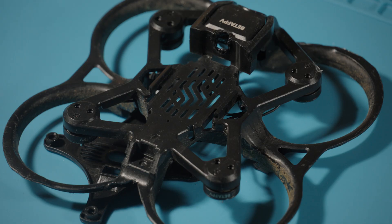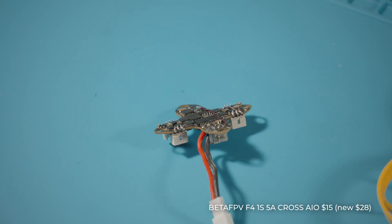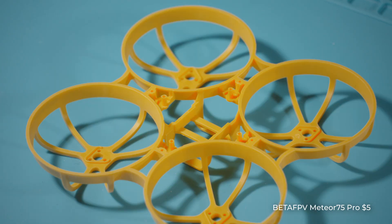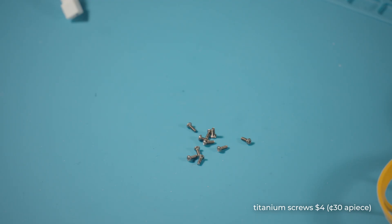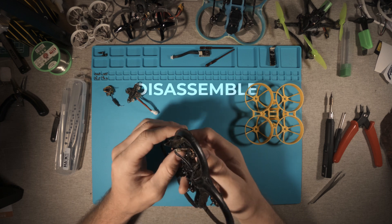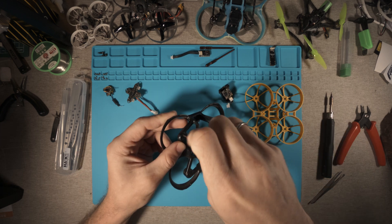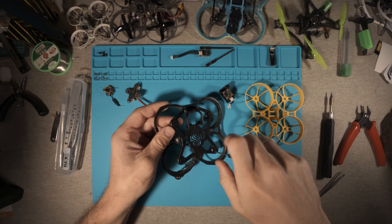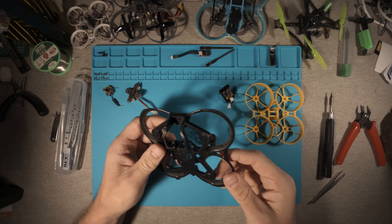To transform this drone we will need a new VTX and flight controller, because the ones installed work very badly and cannot be upgraded. New frame from Meteor 75 Pro — it is much lighter. The titanium screws are the best solution for such drones in combination of reliability and weight. I picked up a lot of this stuff at an internet flea market, so the whole upgrade cost me less than $30. Since not everywhere you can find these parts so cheaply, I also noted the cost of new ones. From the Aquila 16, only the motors remain.